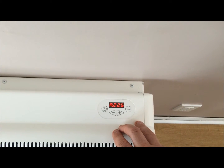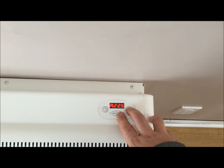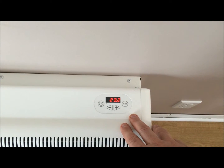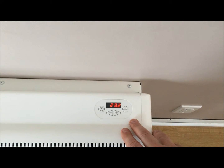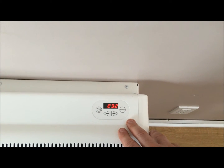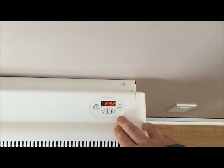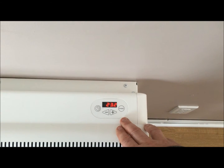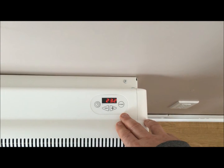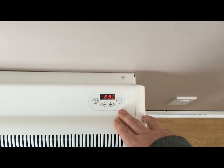If you desire to know the room temperature at the floor, press the mode button and the plus button at the same time. This will display the room floor temperature only. The temperature at eye level height may be a few degrees warmer. If you have a draft next to the heater, this will also cause this reading to be lower, and it may cause the heater to work unnecessarily, costing you more money. This is why it's very important to keep your windows and drafty areas closed.